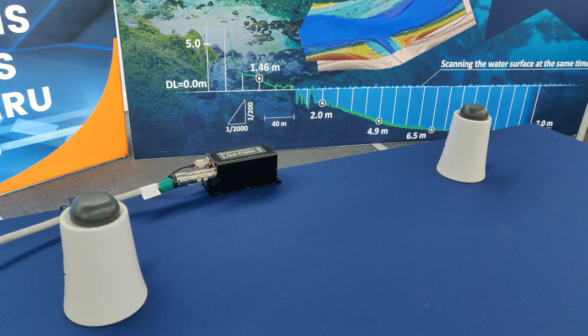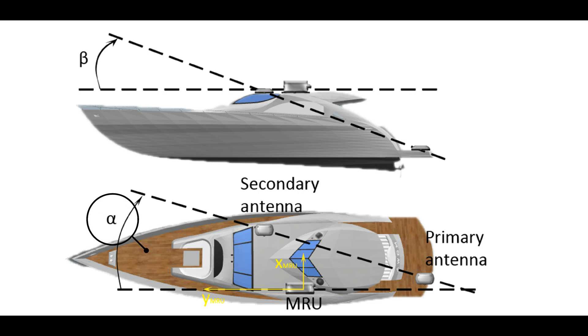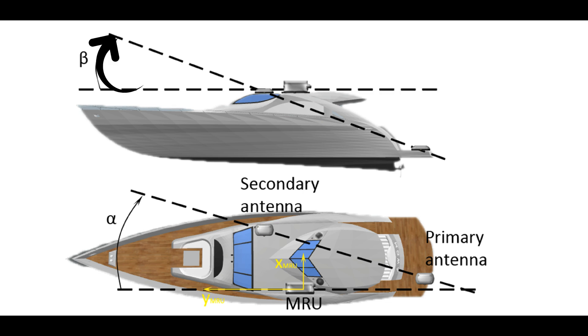Similarly, do the same with the secondary antenna, or alternatively enter in the secondary antenna position as antenna baseline orientation angles alpha and beta. Alpha is the angle of measurement determining the secondary antenna's angular offset in the device's lateral plane, measuring off of the device's longitudinal axis as a reference. Beta is the angle of inclination determining the secondary antenna's angular offset in pitch, measured using the device's lateral xy plane as reference and comparing this to the inclination angle of the secondary antenna in relation to the primary antenna.